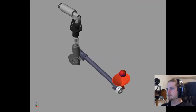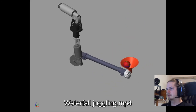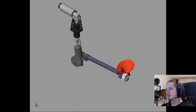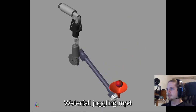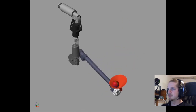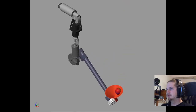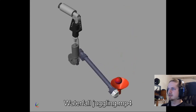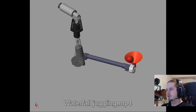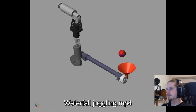With all the components put in place, we can check how it looks and performs. From a mechanical point of view, we see that all the parts are moving somewhat as expected. There is no obvious clipping, all the joints seem to be in the correct places, and the inertia of each part seems to make sense. Now the electronics aren't as obvious in this one, but they seem to do their job actuating it dynamically rather than kinematically. To further investigate the electronic aspect, I would recommend checking the Simulink model and the graphs produced from there.